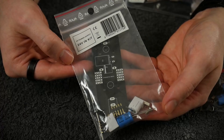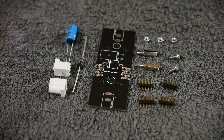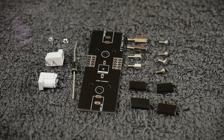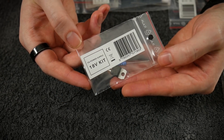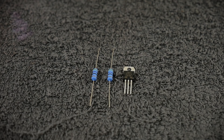Included in this kit we have a 24V inboard, allowing you to connect the 24V AC to DC power brick that will supply the rest of the PCBs. A 24V throughboard allows you to pass 24V out to a second Anasounds power supply if you are wanting to expand out with a K Plus or another DIY unit. Supply boards contain the filtering and sockets for each output stage. And 9, 12 or 18V kits contain the voltage regulator chip and the resistors required to turn each supply board into the voltage you desire.